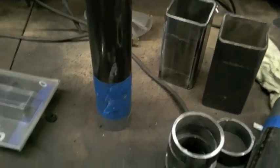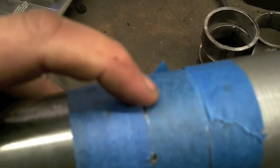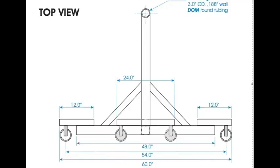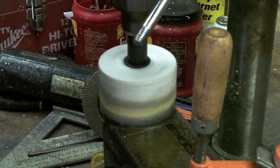There are several spots throughout this process that require drilling. These holes are to control the rotation — it's a lock point for the car rotisserie. There are four fixed points where the car can stay stationary without rotating, and a pin will go through these holes. The next few days required a lot of drilling. The rotating sleeve needs to fit into that vertical piece in a semicircle. This cut is difficult because there's not a good way to cut a perfect circle, so we used a tool called a hole saw with the same diameter as the vertical pipe, which allows for an almost perfect semicircle to be cut.